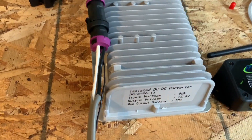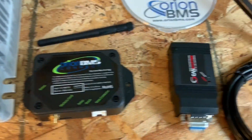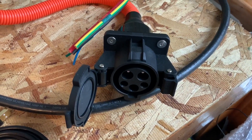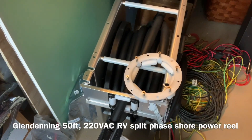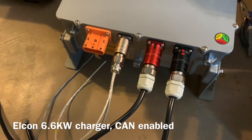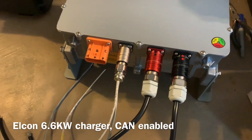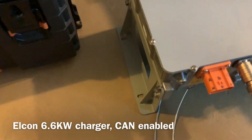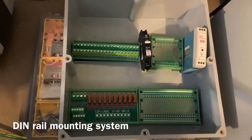This is the 96-volt to 12-volt DC-to-DC converter, the remote monitoring, the Wi-Fi remote monitoring, as well as CAN bus. We're going to interface it to J1772 — the BMS 2 has that capability. I'm also going to show how we're hooking it up to an RV plug through a wire reel from Glendinning, and a 6.6-kilowatt Elcon charger for the battery pack. It can be charged via shore power or EV charging.